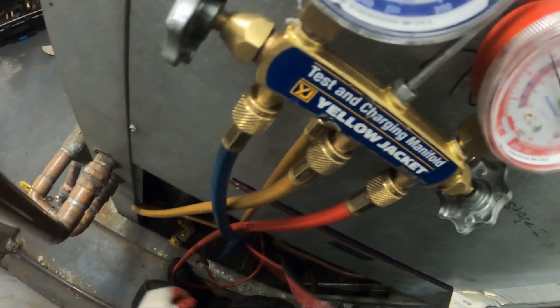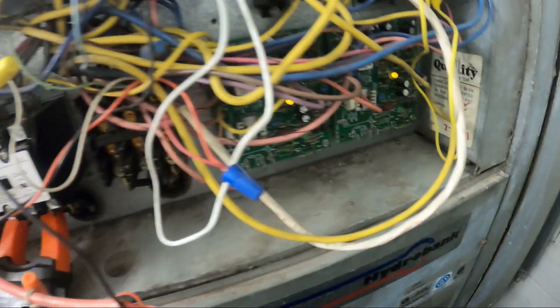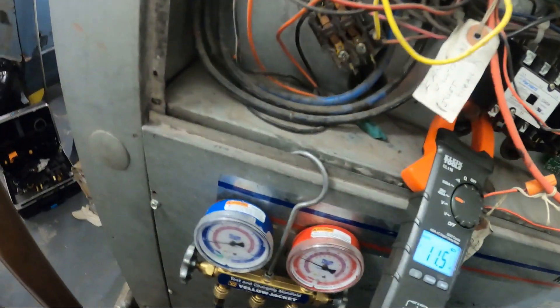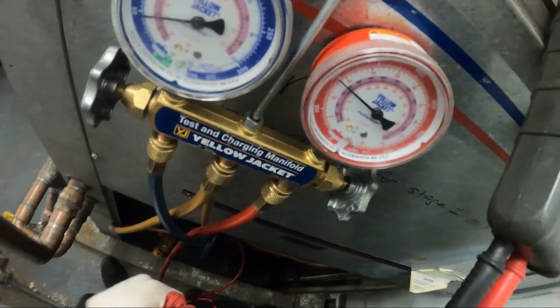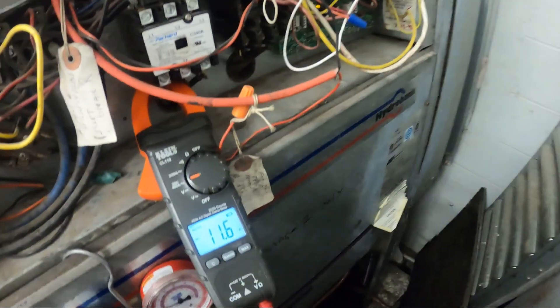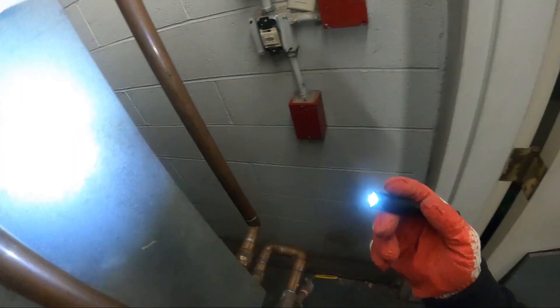This is R22. Pretty much what's going on here was the thermostat. The thermostat has dropped all the way and it's not calling for the next stage. At the same time, we are low on refrigerant on this circuit and low on refrigerant in the second circuit. It's two separate circuits here, two compressors. They are both running now — it just wasn't getting the call.